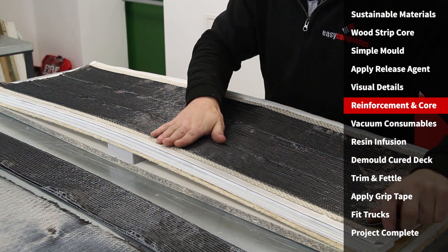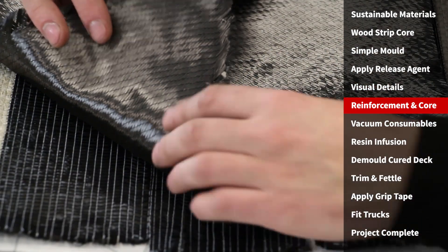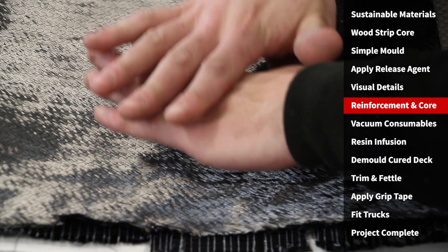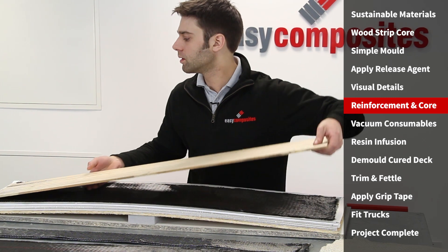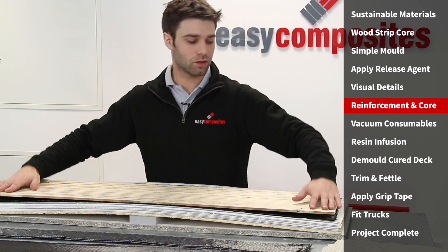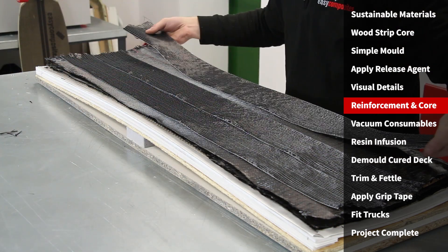The layup itself is probably the easiest part of the whole project — simply lay the material into the mold ensuring it is properly aligned and positioned. This is a plus-minus 45 degree biax cloth; essentially it's like having two unidirectional materials on top of one another at 45 degrees, giving us torsional stiffness on the board. So that's one side of the laminate done. Then we've got our pallet wood core which just places in like so. We're going to use the vacuum to bend this down to the tool later, so we don't have to worry too much about it. In nearly all circumstances with a core, you're looking to balance a laminate either side of it, so we're just going to repeat the exact same layup in reverse.